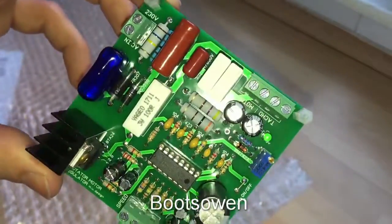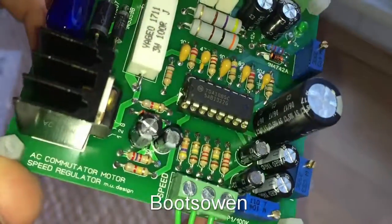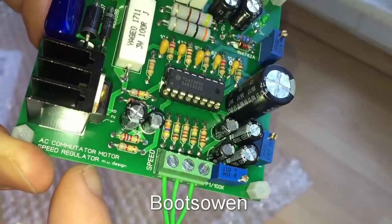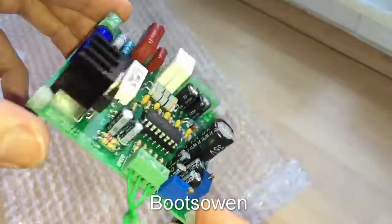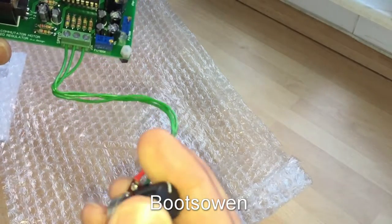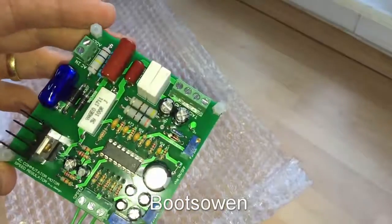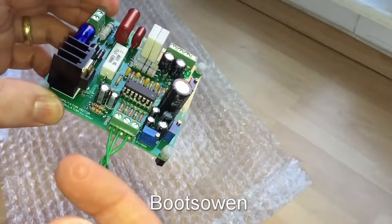I'm not going to wire it in just now — I'll do that another day in another video. I'll post this now and see what people think of it, and if anybody has any observations before I wire it in. It's a TDA1085C motor speed controller. I don't know what 'm.u.design' is — that might be the circuit board name or the guy who made it. One of these blue trim boxes is max speed, one is min speed, and then you fine tune it with the potentiometer. I'm glad I've invested in it because I want to use this on the big grindstone project. I'm hoping it has enough torque that it doesn't overheat trying to get the grindstone started, but if I blow it up, well, we'll find out. Thanks for watching — see you later.